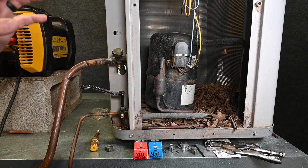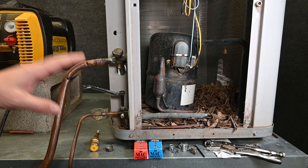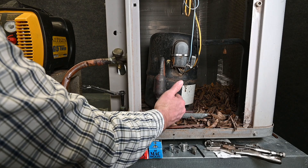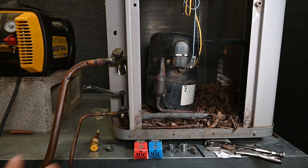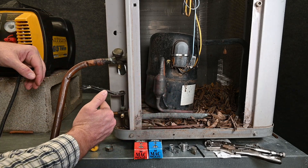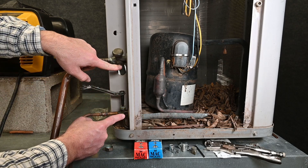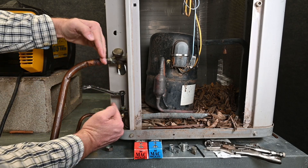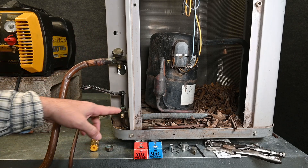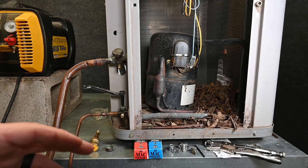Personally, I like to recover while I'm still at the job, since I'm already doing a whole bunch of other work and already have my recovery machine and extension cords set up. But either way, when we do that step, we don't have access to the refrigerant inside this condensing unit like we did before. When we close these valves off, it separates each side. Our Schrader port, where we hook our gauges and hoses, is connected to this side when these valves are closed. So if we're going to try to do recovery, we wouldn't be able to use these ports as they sit. So we have several different options.